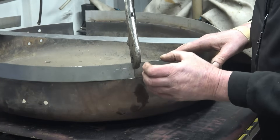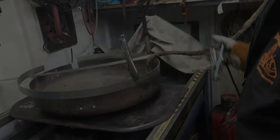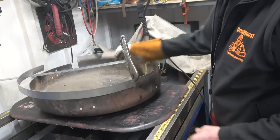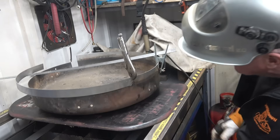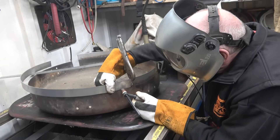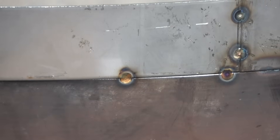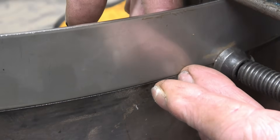The idea of the tack is to get an instant hard punch that fuses it together — really strong, really quick. I've got a separate earth off my welding bench and the foot pedal down here, so I'm basically ready to start putting some tack welds on. I'm making really nice shiny tack welds so you can bend it into shape. I've got some nice clean spot welds and I've used a J clamp to pull this into place.